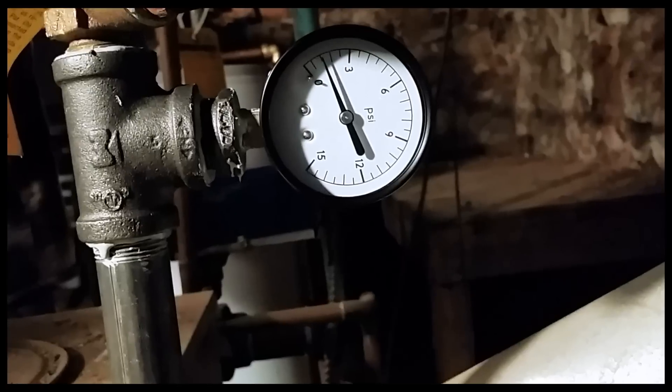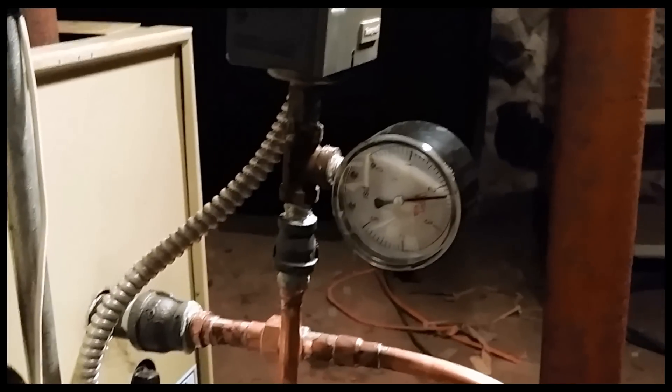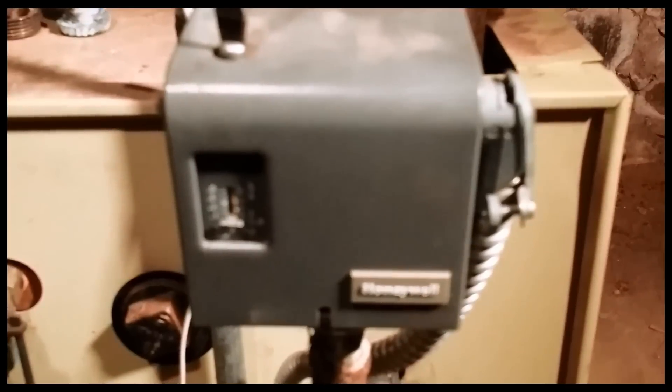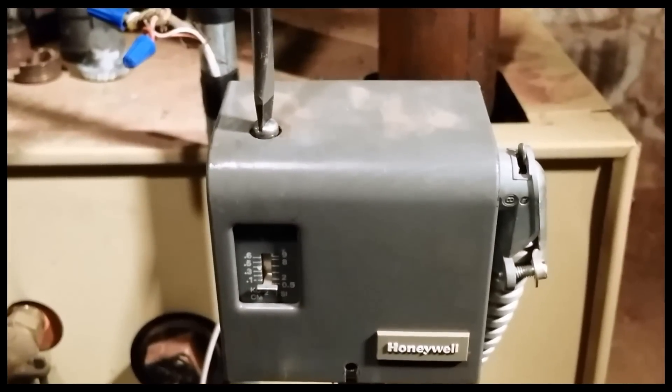Back here is about a pound and a half. You've got two in the front. The switch has got to be adjusted to shut it off now — we don't want it too high. So let's adjust it. We can adjust it down a tad. We're going to bring it down a tad. The problem is which way is down? Clockwise is up, counterclockwise is down. Do a counterclockwise — it'll go down. Quarter of a turn down. I want to see it restart.